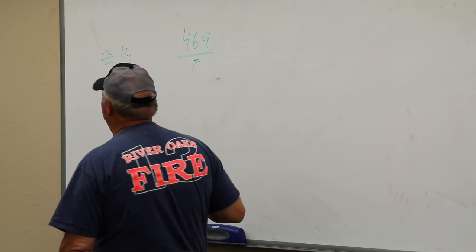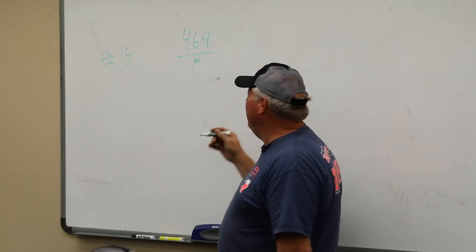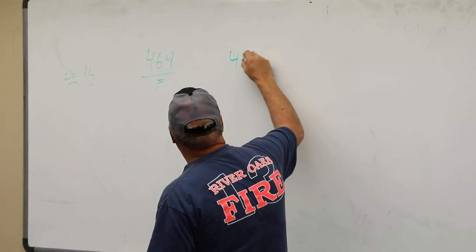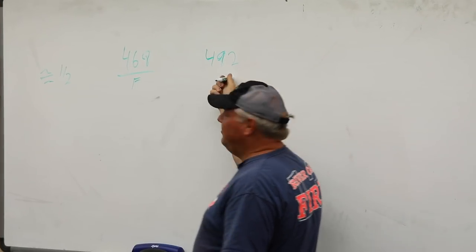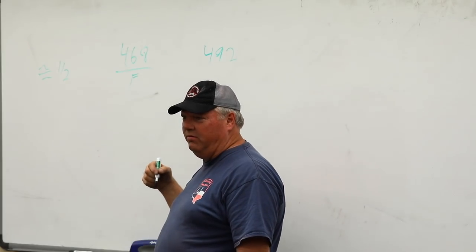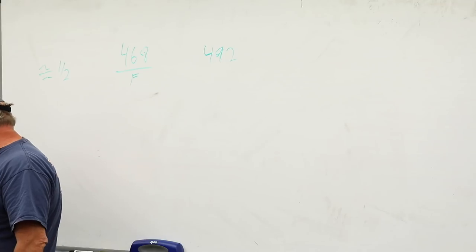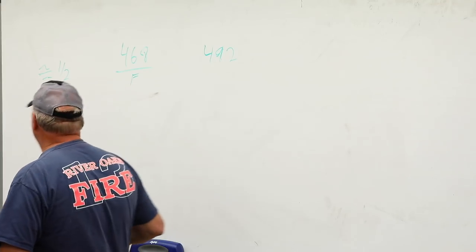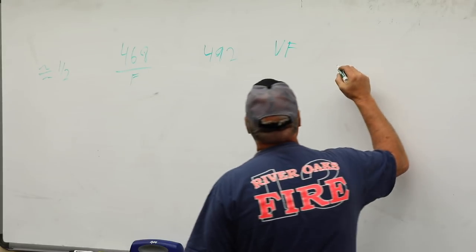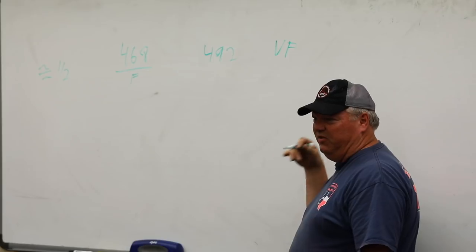And the 468 is what the ARRL or somebody came up with. The real number is 492. We're not going to dwell on that. That's without the velocity factor. Do you guys know what the velocity factor, the VF of your cable, is? The velocity factor is going to be something lower than one. One would be perfect. One would be the speed of light.